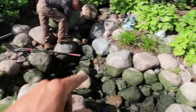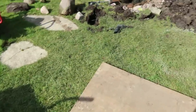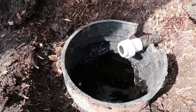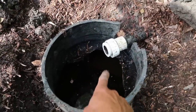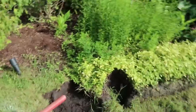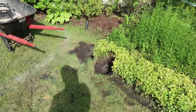First up is removal of some of these elements like the bowls and skimmer — that kind of stuff is one of the first things we did. You can see the guys working on that. We've got the area covered with plywood to protect the existing turf. I wanted to take a second and show you this sump pump system that we are going to be reinstalling. A few years ago we put this in to help manage a lot of their storm water that was becoming an issue. It's always wet in this area, so we ran a French drain along the front of the pond and along this side, as well as taking the overflow from the skimmer itself. Anytime this pond fills up with water, the excess comes down through the overflow pipe, fills up this sump pit, and then is discharged through a sump pump that ties into an inch-and-a-half line that runs out to the street. So we are going to be moving this back over here, and the existing skimmer is going to end up coming over into this area.